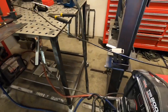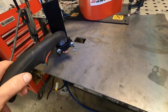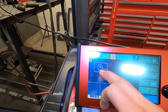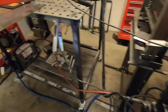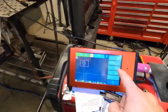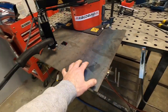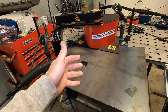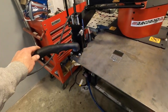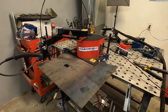If I ever wanted to cut another one, I would just move the torch right here and press zero again, then move it over to the next position. It's expecting to make its cut right in the center, and that's when it will make the next cut. So any time you want to make a cut — instead of copy-pasting — you just move the torch, re-zero, cut. Move the torch, re-zero, cut. Which is really great because your panel's available real estate changes as you continue to cut different shapes of parts, and to get the most out of your material it's really good to just move the arm and start cutting.